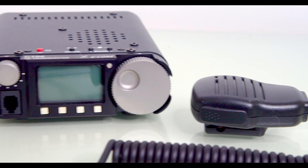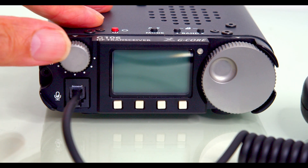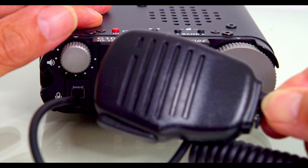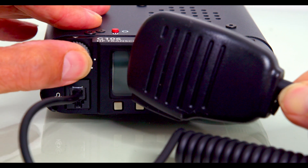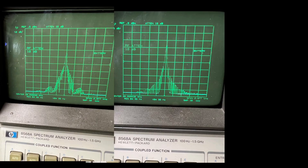The radio comes with a simple PTT speaker microphone that connects via a modular plug to the socket on the G106. To switch on the speaker microphone and switch off the speaker, you simply press briefly the volume control once, and press it again to go back to the speaker. Now, the hoax video I referred to at the beginning showed very dirty outputs on both SSB and CW. But here you see the shots from our own lab — these are close-in displays of the signals, perfectly clean, and this was confirmed on a wider spectrum display as well.